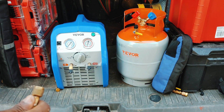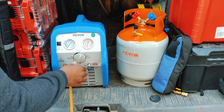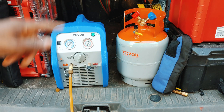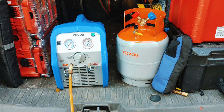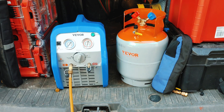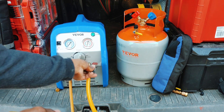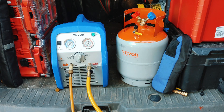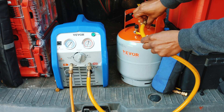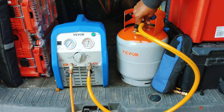That's the hose. I'm going to go to the inlet of the recovery tank — okay. Now coming out of the outlet side, I'll grab the bigger hose. I usually put the bigger hose on the high-pressure side. I'll screw that on, come along the back side, and screw it directly onto the low side. I always like to weigh my charge out, so I'm going to get my scale.